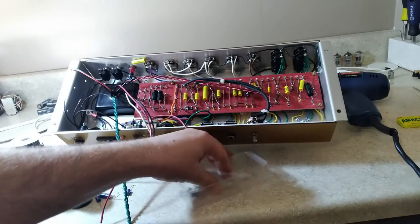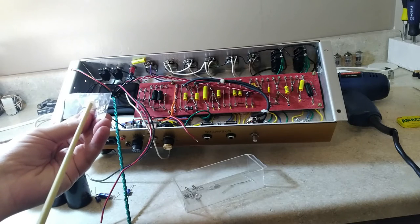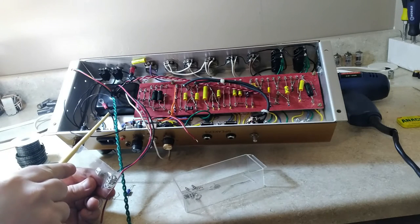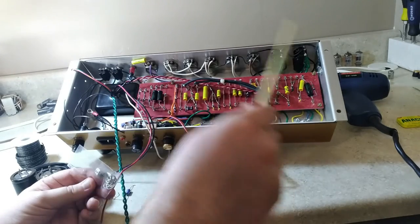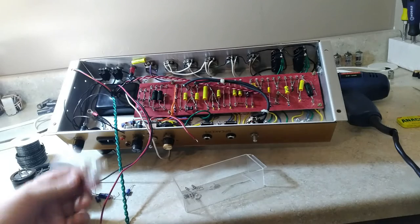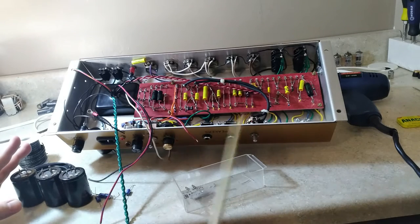I picked up some ground washers — the kind that go on a number-eight screw — from Antique Electronics or Amplified Parts. I pulled off some crimp connectors that didn't crimp well with my cheap tool and replaced them with better grounds. All preamp wiring is grounded at one point, the bias point ground is at another, and all the power amp wiring including the capacitors for the power amp section are grounded together. That's the star grounding scheme for the power amp — so each path doesn't induce voltage across the wire from high current, which can couple into sensitive areas and cause hum.